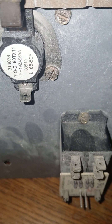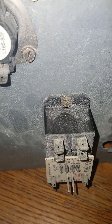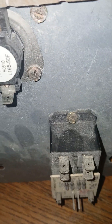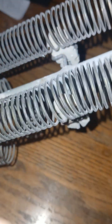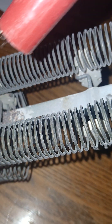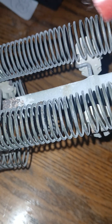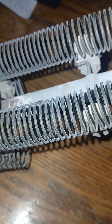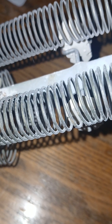When the heat strips light up, if one is unaware, the following month their power bill may be high, because this unit has a set of coils that get cherry red. It builds up heat, and once the heat gets in here the blower motor blows it through the ductwork into the home.